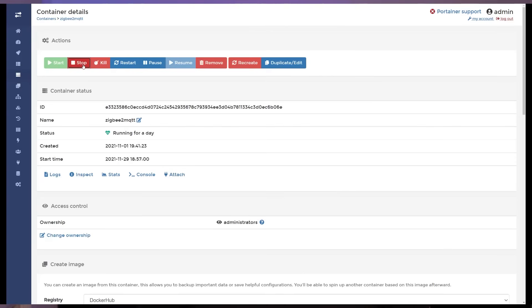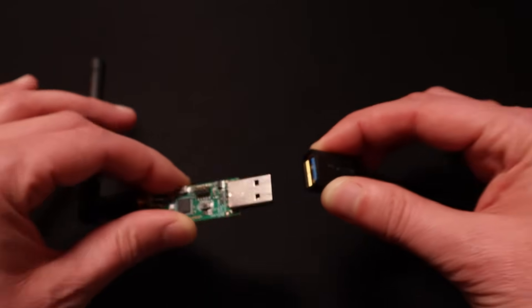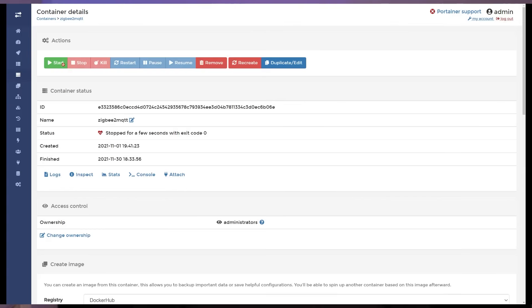When I moved to a slightly bigger house, it had a few issues with range and some of my sensors that were far away stopped reporting information and wouldn't work properly. I fixed this by adding a few smart light bulbs into my network which acted as routers, but I'll touch a bit more on that later. As my Zigbee network grew I found that my USB coordinator would stop responding entirely every couple of weeks, and you'd have to stop Zigbee2MQTT, pull out the dongle, plug it back in and restart it before it would start working again. I also noticed that it became harder to pair new devices as they just wouldn't get detected.